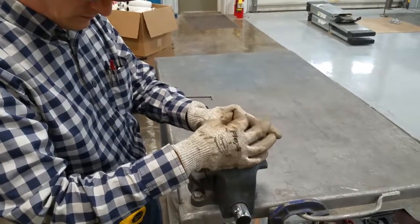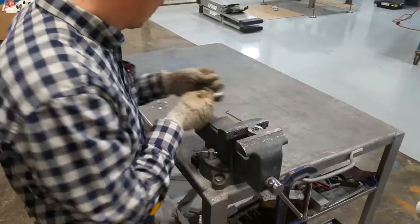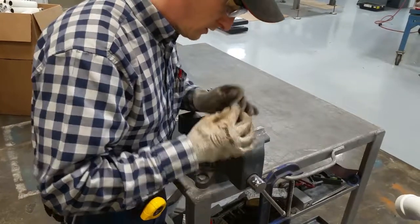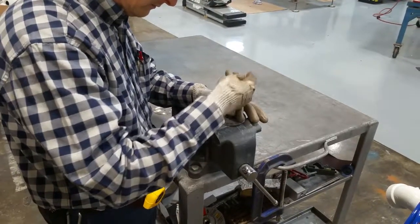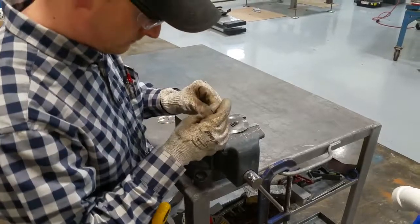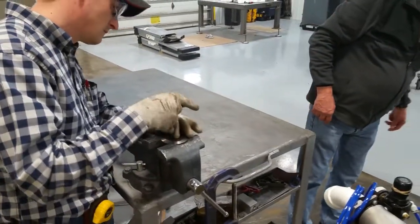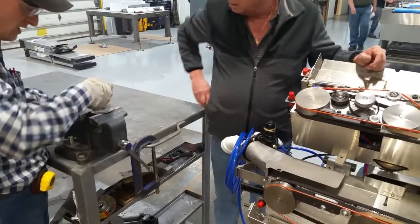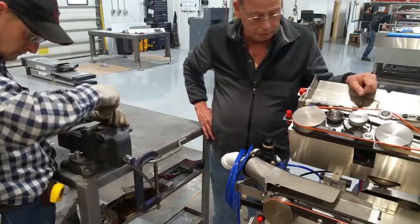Now, there's a lot of these machines floating out there. You wouldn't believe some of the industries that use this heat sealing stuff. Most common in the bakeries is for bagels and whatnot, and a lot of double loaf baggers will use them. Old blade comes off. New one goes on. The way it is, it ain't real picky on folds either. It'll seal through several different layers. Obviously recommend reassembling this with Loctite. We always use a little blue Loctite on everything we put together.